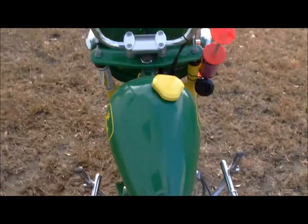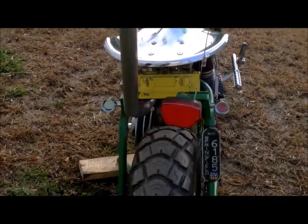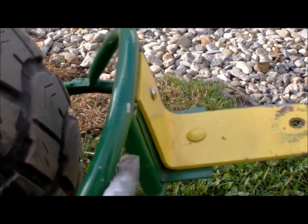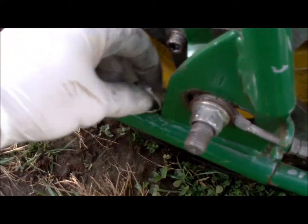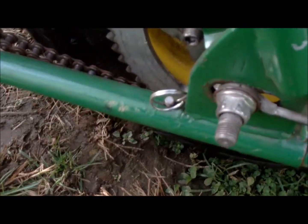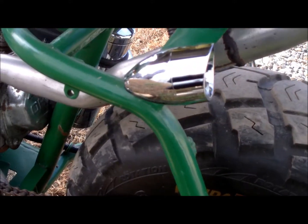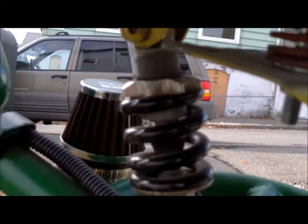From behind, it's got a trailer hitch - custom made out of conduit. I just tack welded it all together and slipped it inside the frame and pinned it right here, so I can pull these pins out on each side and take it right off. I actually have a fender for the back but it fell off one day and I decided it looks better without it.